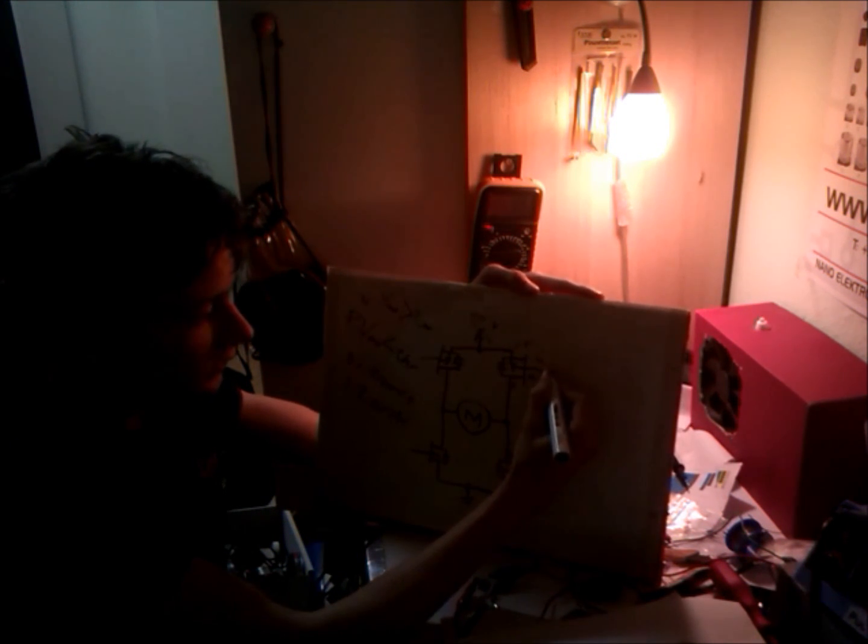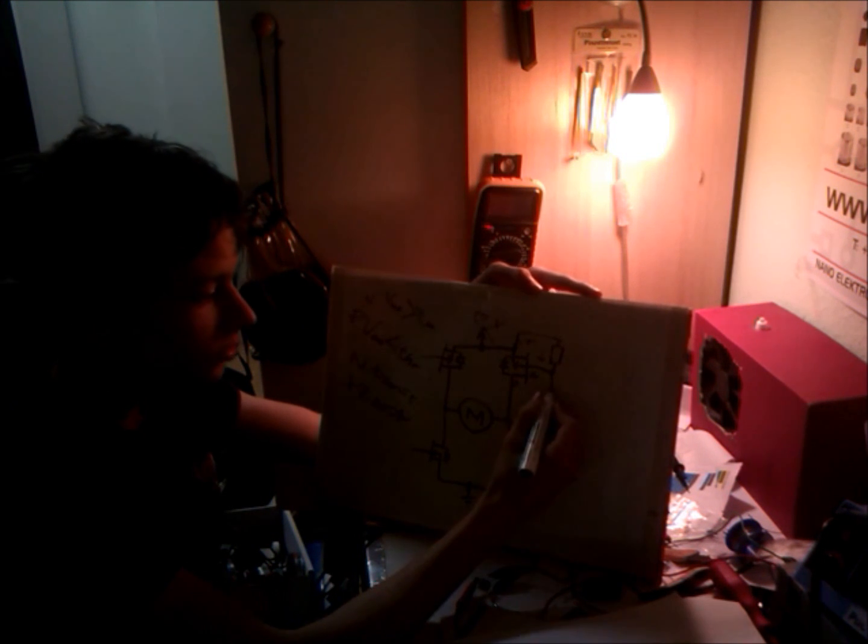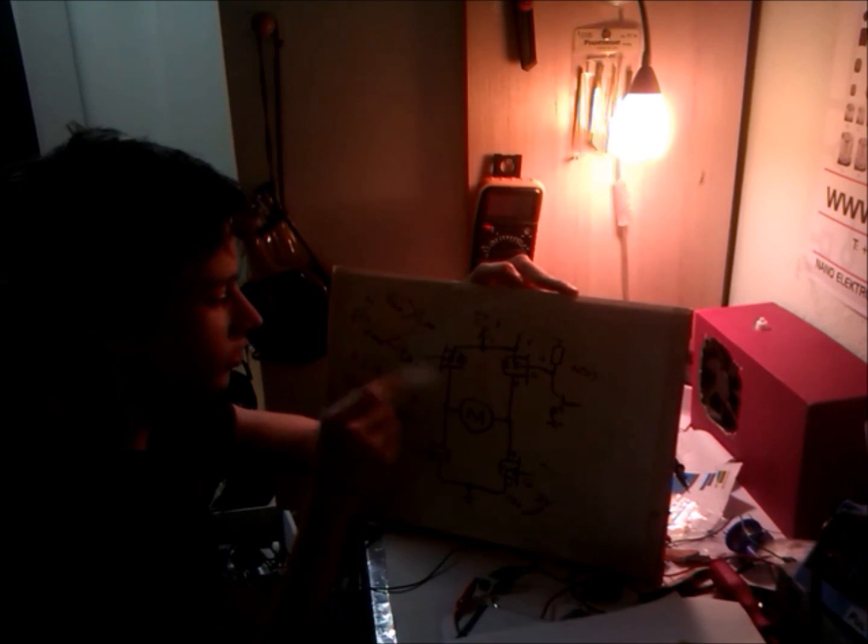So if you want to drive these guys, the best idea is to put a resistor between gate and source, and then pull it low with another N channel, or just a bipolar NPN transistor pulled to ground. And also, what this does, this acts like a NOT gate, actually, and this solves many problems with these guys. So you don't have to change stuff in software about the high and low levels. So you do the same, of course, on the other side.